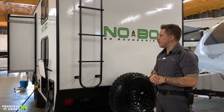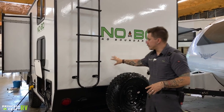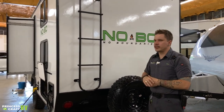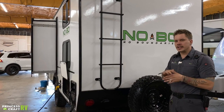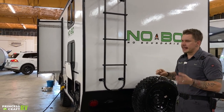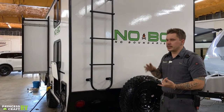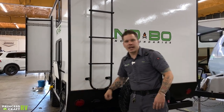So what we have here is going to be your rooftop ladder access. That brings me to a great point, which is structural maintenance. Anywhere where two pieces come together, they are going to use some sort of sealant. It is our goal to inspect that sealant every 90 days and touch up as necessary. On the roof, what they're going to use is an RV grade self-leveling lap sealant. Generally, what we're looking for is any degradation — whether that's cracking, peeling, or separation of any kind. On the roof we're going to do some spot sealing; since it's self-leveling, you apply that heavily and let it settle out. On the body of the camper, we're going to use a 100% silicone product. You can source that from any hardware store or pick it up from your RV dealer. Touch up that bead if you see any degradation within it.